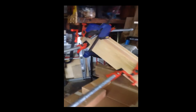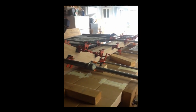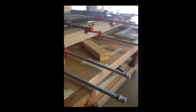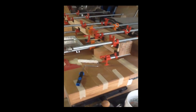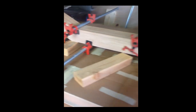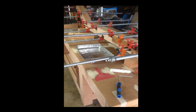This is it glued up — this is the way it's going to stay for three days. I'm not touching this thing for three days, and then there's always some touch-up to do. I'm going to trim the ends, give it some detail on the edges to break them, and it came out pretty good — I'm really pleased with it. Here's my Roubo bench, but it's protected. I like to keep my stuff nice and clean. Cardboard is cheap and really handy. I've protected my bench this way and I've got wax on it, and the four-by-fours you see there are what the whole assembly is sitting on so that when the glue drips it'll be on the wax and not bond to the raw wood.